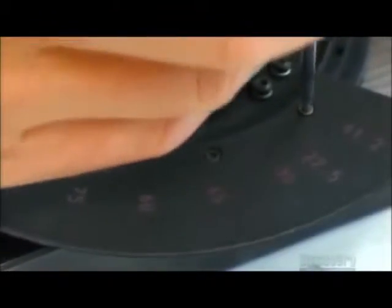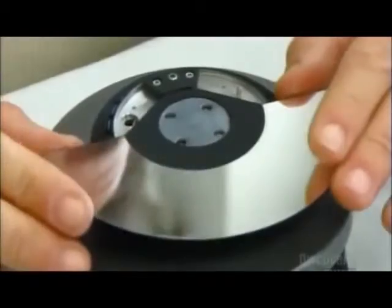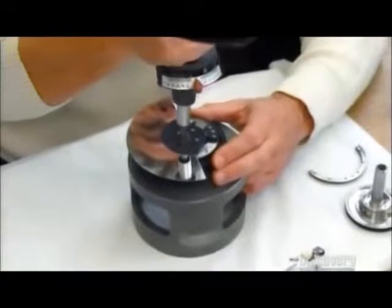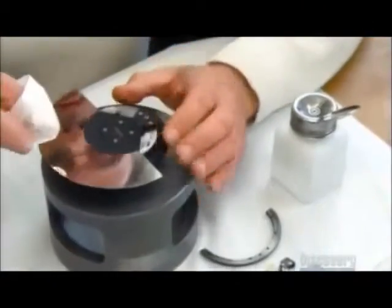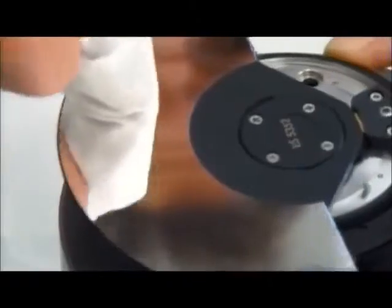This part of the camera is the shutter. It sits between the film and the lens. Workers mount a mirror over half the shutter. The mirror reflects the image into the viewfinder when it rotates in behind the lens. A dab of special cleaning fluid yields a pristine surface. Any dirt on the mirror would create a fuzzy image.